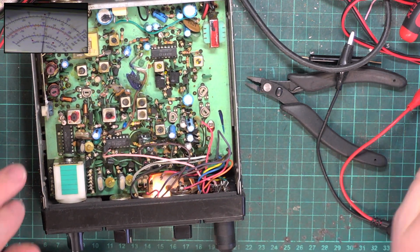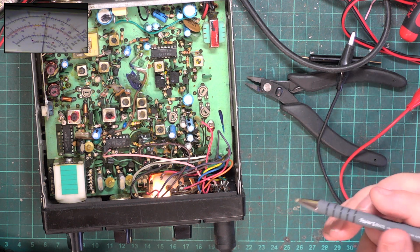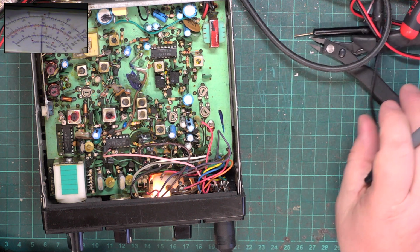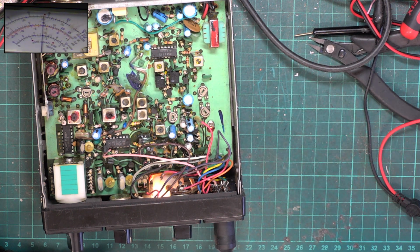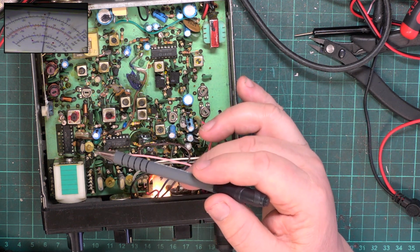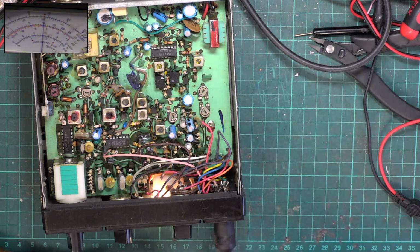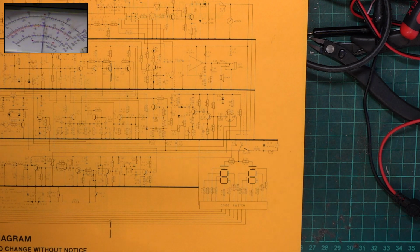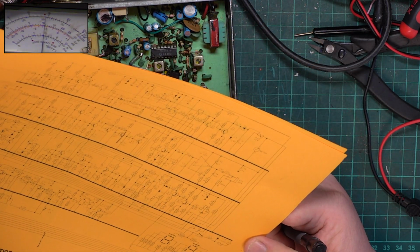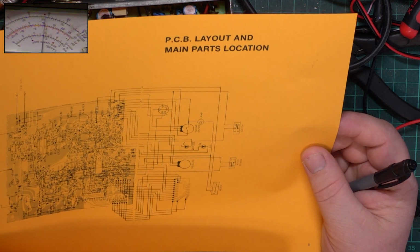Now, we've done these before, and I'm not looking at any of the last notes. We'll go through it again and come to the same conclusions. But basically we have to set the 10.24 to as close as we possibly can. Sometimes it won't quite go. And then we set the transmit, because it has a multi-crystal mixer, doesn't use the normal type of synthesizer chip. It uses a general purpose Motorola, whatever. I printed off the circuit for what it's worth. MC145106 by the looks of that. This is just from the instruction book, which these were handily printed within.